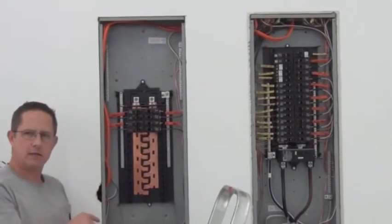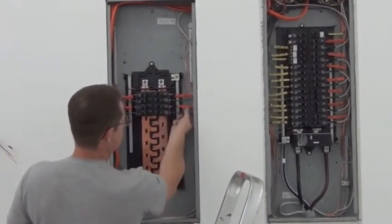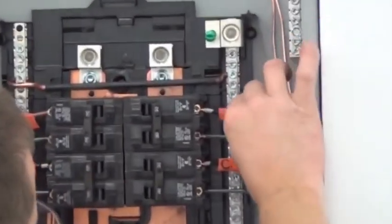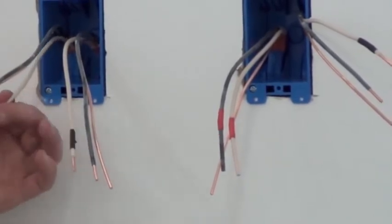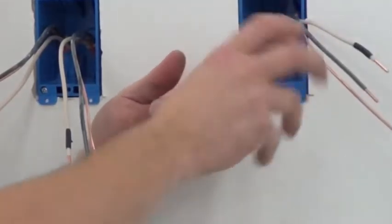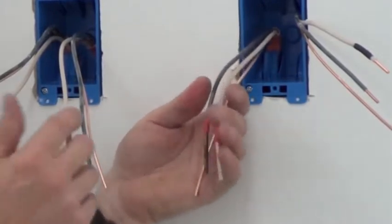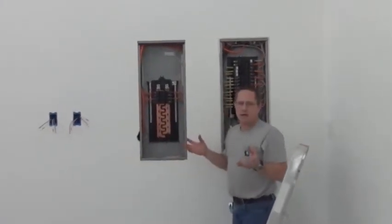The white wire on here is actually hot. So at the ends of the white wires I mark them black. These are my loads, so I take the red and the white wire — marked red. This hooks up to the thermostat, and when the thermostat gets to the temperature you want, it says okay, it's time to turn on, and then it goes up to the red.